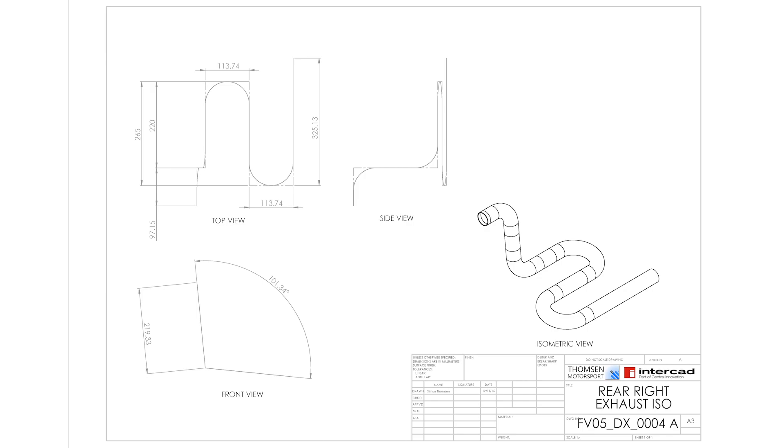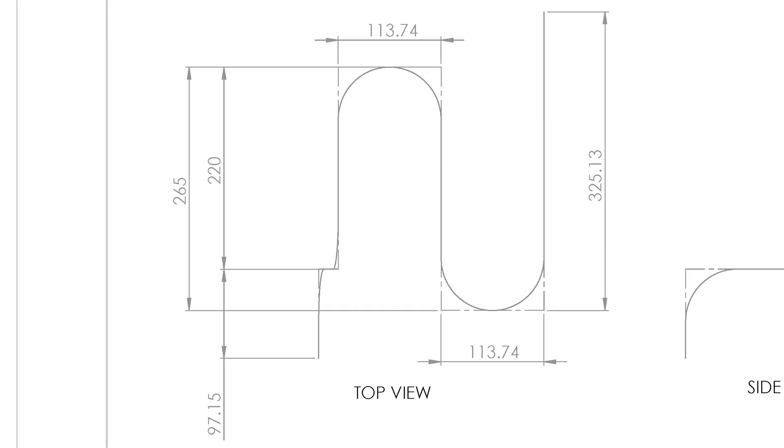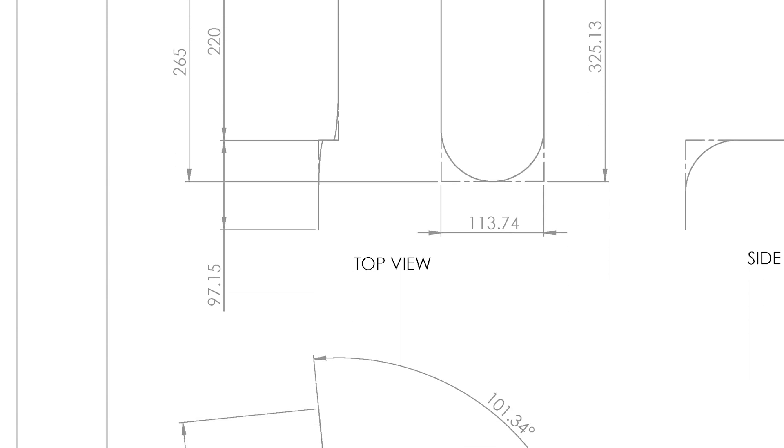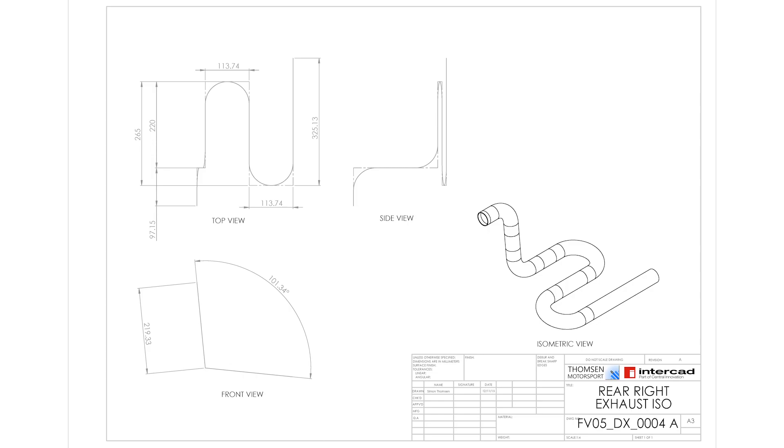Once I had the design, I had to put it into a form which I could use to fabricate the four runners. These gave the length between each node where the straights would meet the corners, which were not radiused in the drawings, plus the angle between the straights. To make things easy on myself I used only 90 or 180 degree corners which can be bought off the shelf. These make building pipework relatively easy as you only need to keep track of a few measurements.